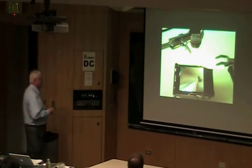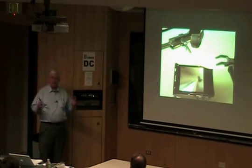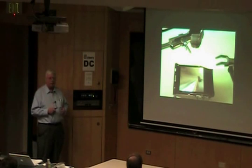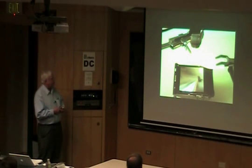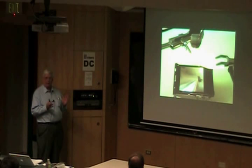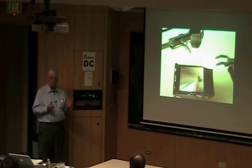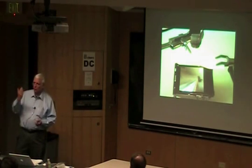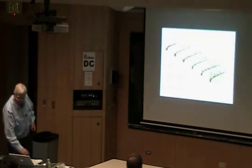So one of the things the structured surface has to do is behave like a concave mirror and make an image back on its own side to regather the light. But it also spreads out that light a considerable amount. Without that, it wouldn't be a focus screen. You'd be focusing your lens and you wouldn't see anything happen because your eye would accommodate to the changing image.